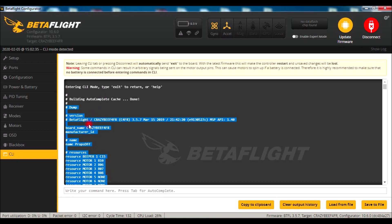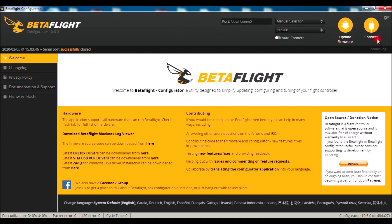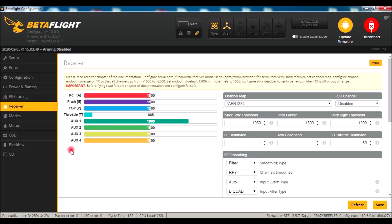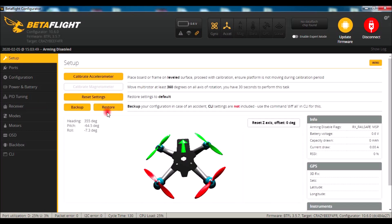I don't know yet if Happy Model is going to come out with a fix on this. If you're using someone else's dump file, you're going to have to change your modes and settings in the Receivers tab, because somebody else's settings might not be the same as yours. Just keep that in mind. It's quite an annoying issue, but that's basically what you've got to do.